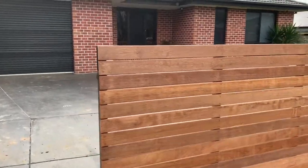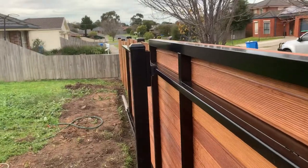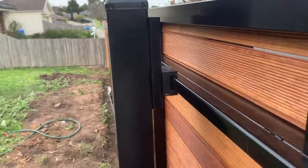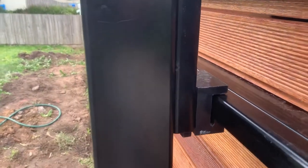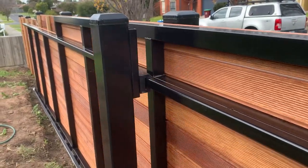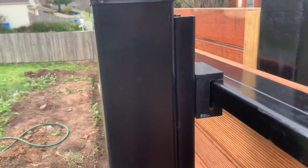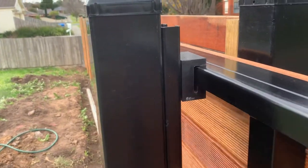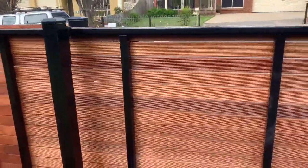What's interesting here is that because of the slope, I've actually got this running on a nylon block instead of a roller system. As you can see, as the gate rolls up the hill, the nylon block is guided along. You can't use the conventional roller in this sort of situation.